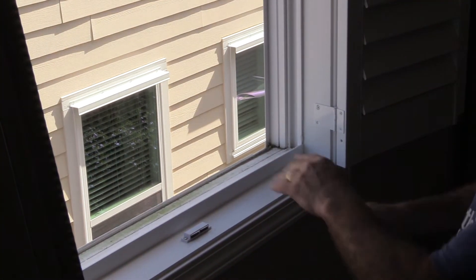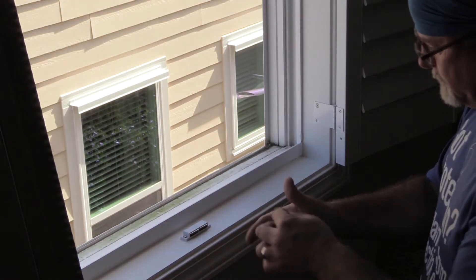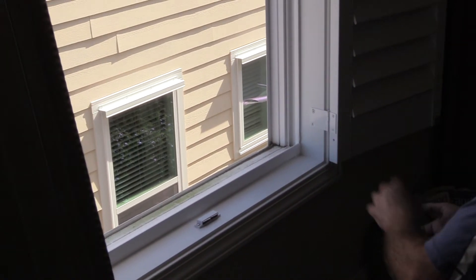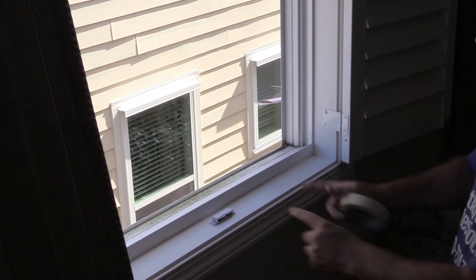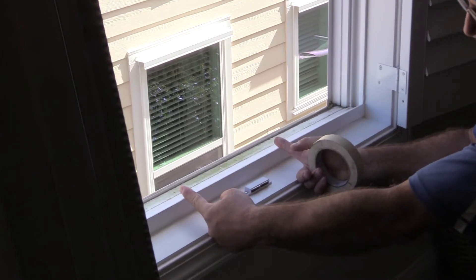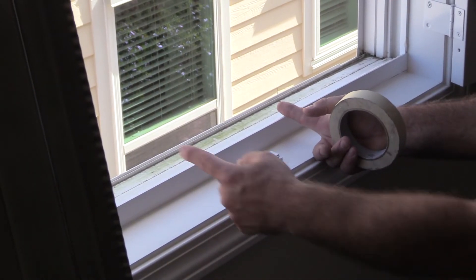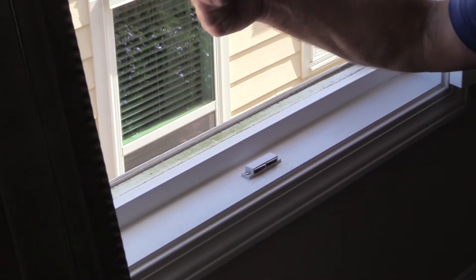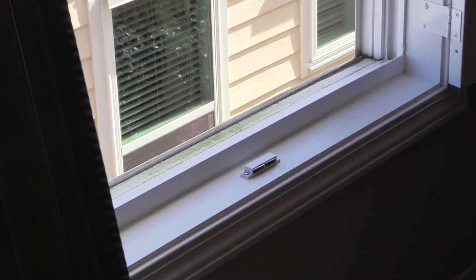Some applications have two bolts each side. Now, these two inside bolts are on black marks. Those black marks are exactly 12 inches apart. We want to maintain that distance so the center panel will fit perfectly. To do that, we take a piece of masking tape and put tape on each side of the bolt on two bolts to keep them from sliding back and forth.